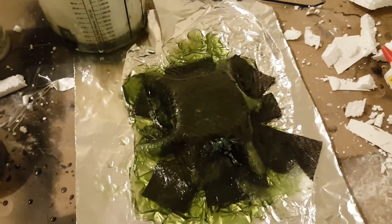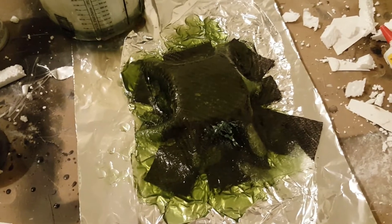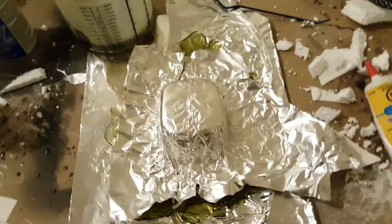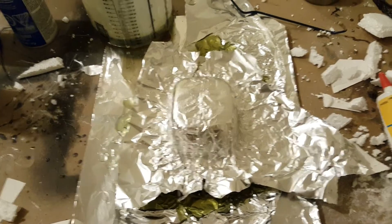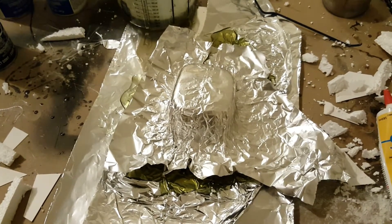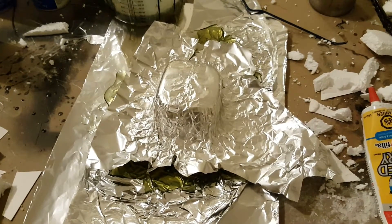I used a paintbrush to apply the resin and soak the carbon fiber. I also added some fiberglass over it to make it thicker, since I didn't have enough carbon fiber. The layers weren't really sticking together, so I grabbed another piece of aluminum and covered everything with it to squeeze everything together and hold all the layers in place. I have no idea what it will look like — probably not great — and I'll have to do a lot of sanding. I'll leave it for at least 12 hours, then take everything apart.